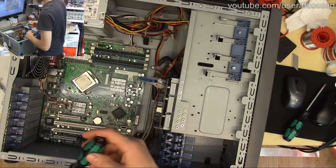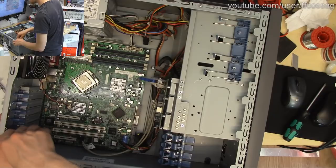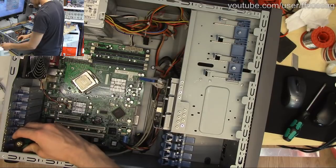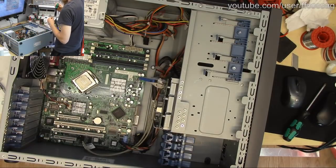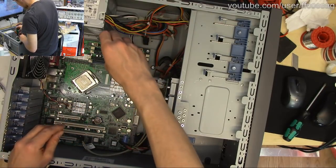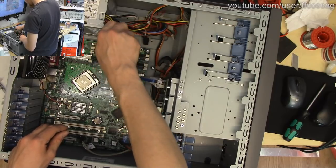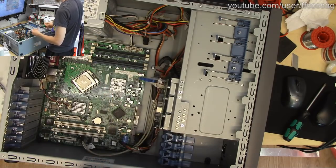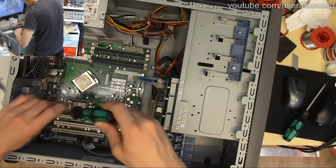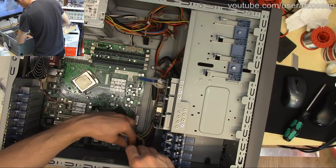Someone says yay for PCI-X. What are you smoking? We have PCI Express today. It's so much nicer. Edward Hartman in chat says they discontinued them, referring to the Rubicon MBZ series, and you cannot buy replacement ones that meet the same ESR spec today that are not polymer. Is that a problem? I mean, if you can get your hands on polymer caps, get polymer caps. They're better.